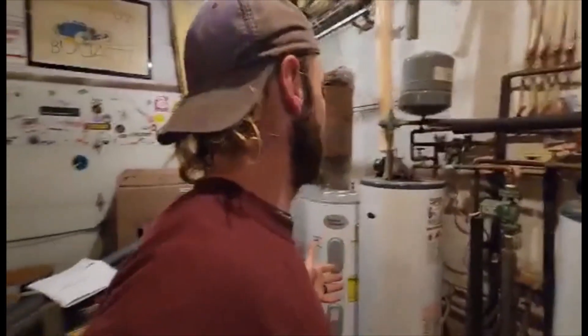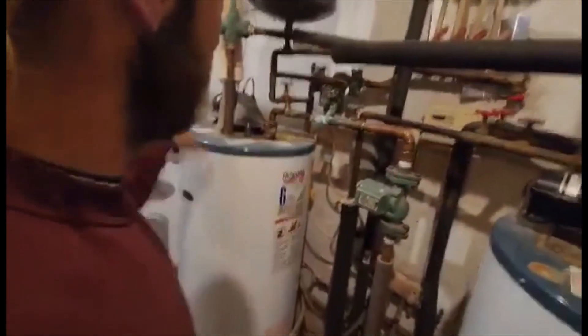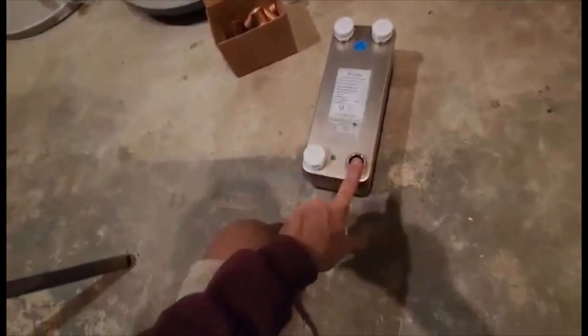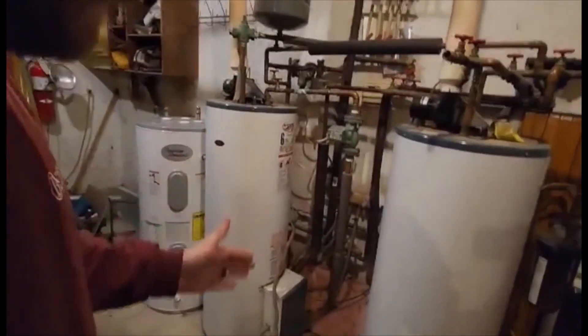Because I'm not here so much, I have a line coming in from the outside wood boiler, into the tank, heats it up, and goes back out to the wood boiler. We're going to separate that system and put in this water-to-water heat exchanger. Water goes in one side, through here, and comes back out this side, completely separate from the water on the other side. That means I can isolate the boiler, run antifreeze in it, and shut the boiler down without losing heat. When I come here I can fire the boiler up with wood, and as soon as it dies down this system will pick up the slack.